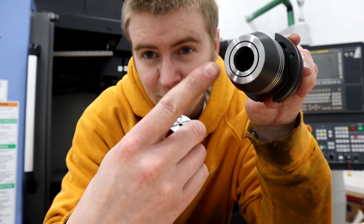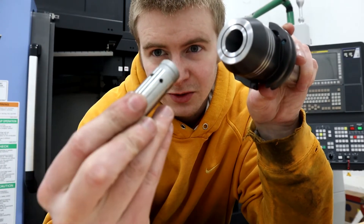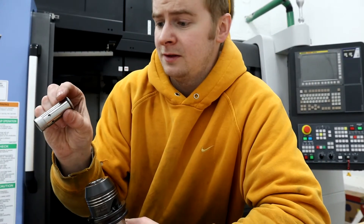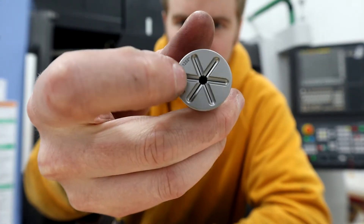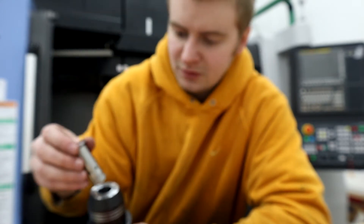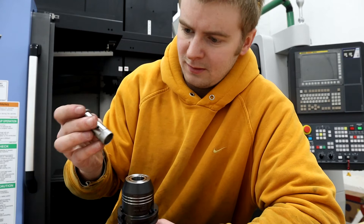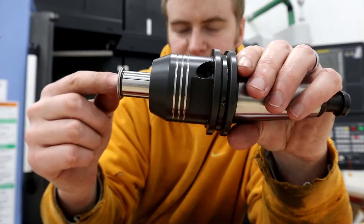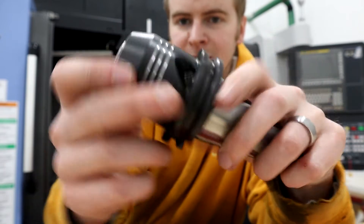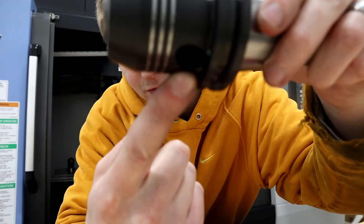All of these come at three-quarter inch diameter and then you need to sleeve them down to whatever size end mill you have. This is an eighth-inch sleeve — it's pretty small but it's got coolant ports. You can get them without the coolant ports too. Essentially, once you get the sleeve in here, there's a plunger — that screw right there is a plunger.